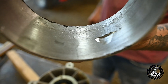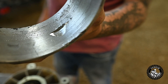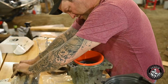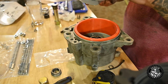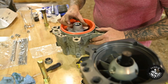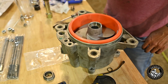Here's the little trick we did to get the wear ring out — we cut a notch in there with a side grinder so you had something to grab to punch it out. Otherwise you really didn't have anything to grab on that wear ring. We got the second wear ring in with the press. Now we're putting in the smaller impeller — that's the outer pump, the second stage. This body here has the big impeller, and that body there has the smaller impeller. That's stage two.